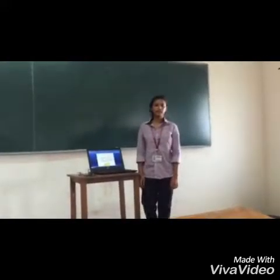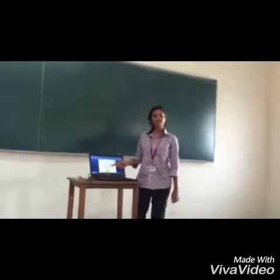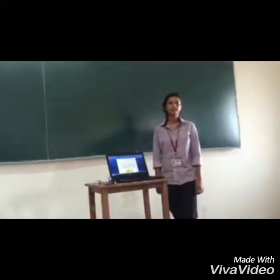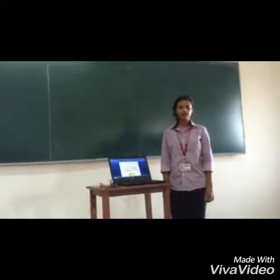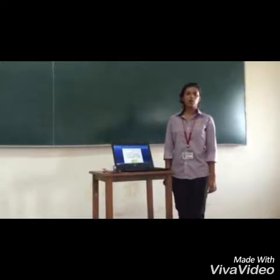Today I will be demonstrating a security alarm using logic gates. This is the circuit which consists of 4 NAND gates. The NAND gate comes as part of the IC CD4011. Components include 2 resistors, a capacitor, voltage supply, BC547 transistor, diode, alarm, and a relay if needed.